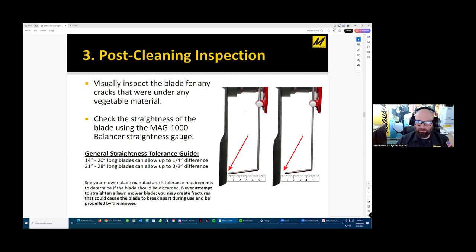Back to straightness: the blade balancer has a gauge rod on the side to check if a blade is straight. You put the gauge rod close to the underside of the blade, rotate it 180 degrees to the other side, and see if there's a deviation. The longer the blade, the more deviation is acceptable. You never want to try and re-bend a mower blade because they are aus-tempered — a hardening process that increases ductility. They are meant to bend once. Once they bend and you try to bend the material back, it can start to crack in ways you may not see.